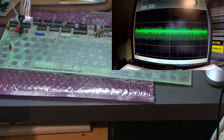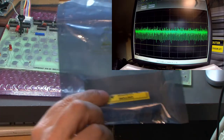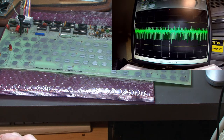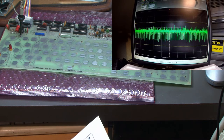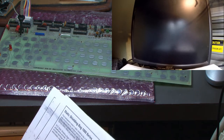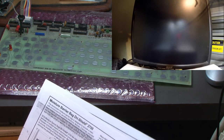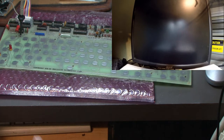So what I came up with, something that we can at least see what's going on, is anti-static bags that chips come in. You can get a data sheet for these bags, and I'll show you the layers. I ordered 4 different kinds of anti-static bags, and we're gonna experiment with these things. I'm gonna put the data sheet up for you, and it shows the layers. I got 4 different types, some with the metal out, metal in, some that have 2 layers of metal, and then one that's really thick, with a thick polyester layer, then aluminum and polyester, then aluminum, and then a heavy gauge of another plastic. So we're gonna see if these things do anything.